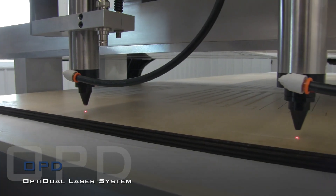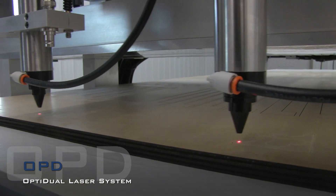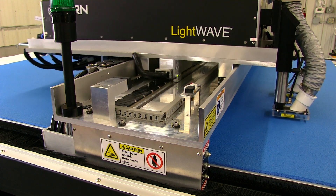This package includes high-speed servo motors riding on a rack and pinion setup at each side of the laser table. A linear motor package is installed on the X axis, resulting in smooth and accurate cutting results.